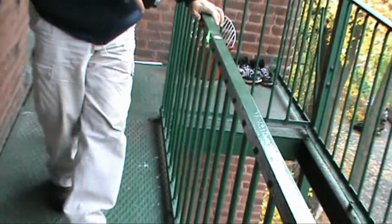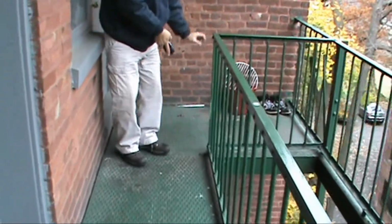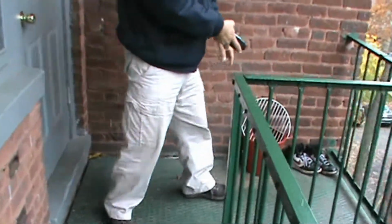But again, all original hardware. So I want all the posts to be swapped out here, but these bars, these rivets don't have to be. These are good. They're just going to be tested. They all look good, but I don't want these to be swapped out because these rivets are not critical major structural, they're minor. But these corners, I need these swapped out. I need this one swapped out.